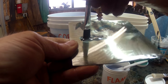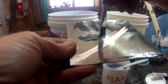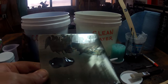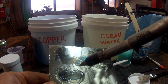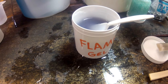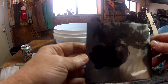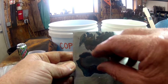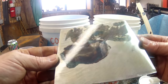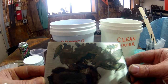If you leave it in one spot in a concentrated way, it's going to get pretty dark. And if you work in the confines of that spot — just to move the chemicals around a little bit — it's going to get very dark. Move that around with a little bit of air just for fun. I like that, so I'm going to freeze that and neutralize it to stop the chemical reaction right there because I like what it was doing. Sometimes if you go too long you just wish you would have stopped it quicker. Every color that you see on this sample piece of steel is all from one product — Flame FX Gel.